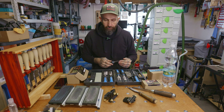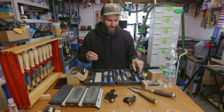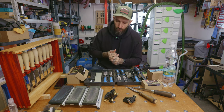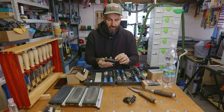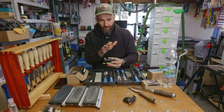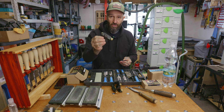On the internet I found a flurry of users commenting: I hate this jig, it's got a bad design, everything's skewed. I did see a pattern of problems that I was experiencing myself, primarily that the secondary bevel is skewed. There was a whole host of explanations for this. First and foremost was: you didn't tighten these equally, or you over-tightened one side or both. The reason being that if you over-tighten it, it slightly cambers the chisel inside the vice. Also, because it's a chisel, I should be using the narrow chisel clamp.